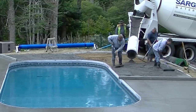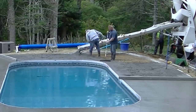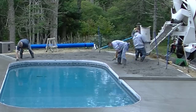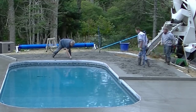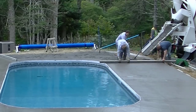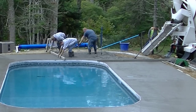There's only one access for the truck, so we're getting the conveyor truck out of there and backing in the second truck. We put a little more yardage on that first truck — the conveyor truck — than the second truck, because we knew having that conveyor would make access a little bit easier than just pouring right out of the chute. This is actually going exactly as we were hoping. We can back the second truck right up and pretty much reach where the chute is. We're being really careful around that Z-Pool form — we vibrate it really, really well, tap it, and mag float it so it's nice and even. We want to make sure we don't have any air holes or bug holes in it when we strip it off, and that the top is right flush so everything looks really nice when we get that form stripped off.